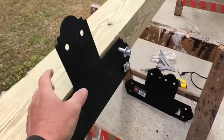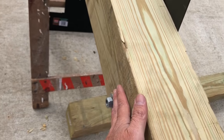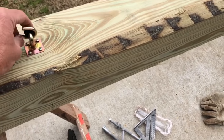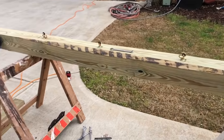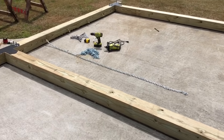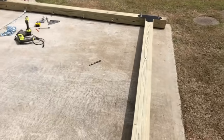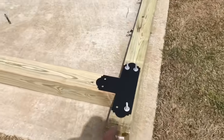What we've done is put the T-brackets on, drilled the holes through, put the bolts through, and we're gonna put the other T-brackets on the back side in just a minute. I wanted to show this while we have it set on the sawhorse — we went ahead and drilled these in and finished them up. That way when it's up in the air you have that already done, and we'll go ahead and hang the chains from that as well, so everything is done and you're not working too much on a ladder. After drilling all the swing pieces for the chains and bolting them all up, I went ahead and laid it on the ground — find a place like your driveway that has some straight square lines so you can lay these big heavy boards.